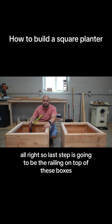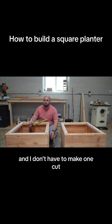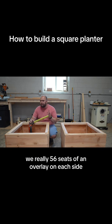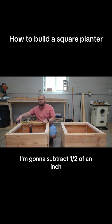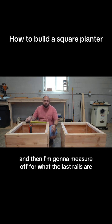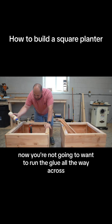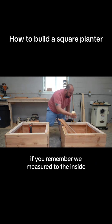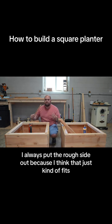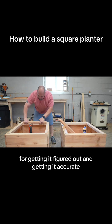The last step is the railing on top of these boxes. I'm going to make them approximately two and five-eighths wide because I can split the board right in half with no waste and only one cut — it works out perfectly. I'm going to make approximately a five-sixteenths overlay on each side. To keep the math simple, I'll take the inside dimension of 20 inches, subtract a half inch to give me a quarter inch on each side, leaving 19 and a half inches. I'll cut the first four boards at 19 and a half, then measure for the remaining rails. Putting some glue down and nailing them on — don't run the glue all the way across since these boards don't go all the way across. I always put the rough side facing out because it fits the appearance of a cedar planter box.